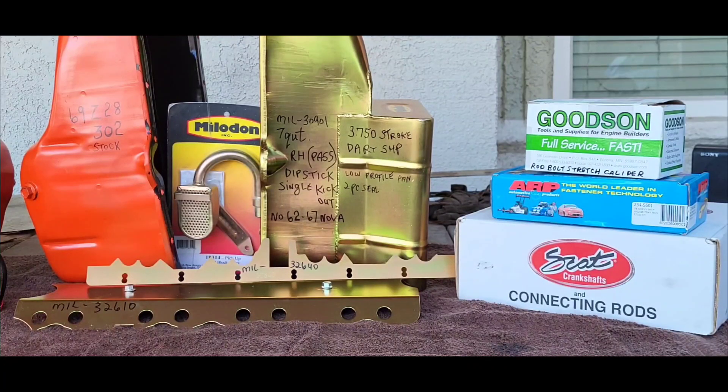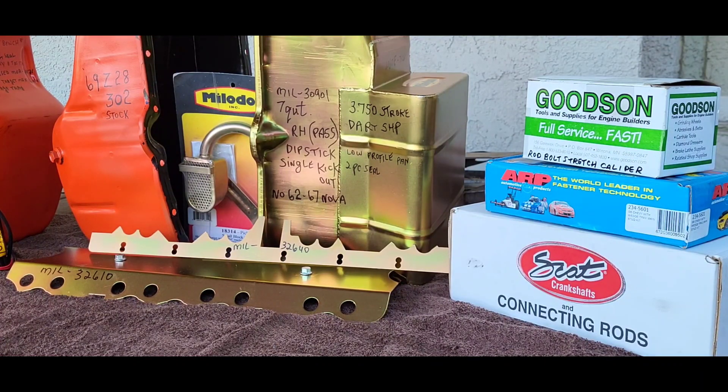By now you've probably realized there's a lot of information to gather. A notebook is a good idea. I usually write specs on one page, part numbers on page two, sizes of parts like quarter-inch national pipe plugs or quarter-inch MPT tap on another, then a page for tools required, questions for my machine shop, things I liked, things I did not like, and one called anomalies — things that deviate from what is standard or expected.